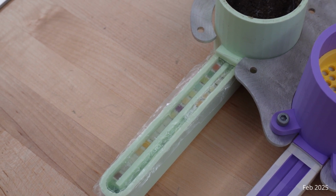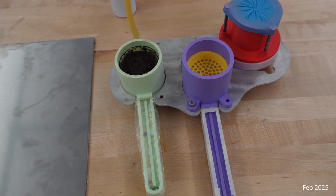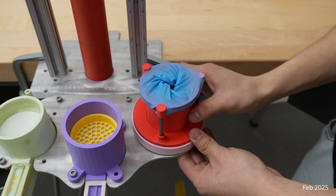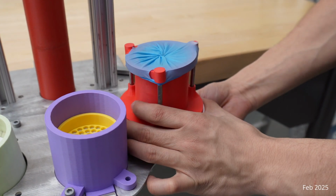At the conclusion of the first test, the auger rotates to direct the collected soil into another testing chamber for the second sampling site. For the cache sample, the auger rotates to deposit into a third container, which is rotated by a stepper motor to be sealed. This can be easily removed for examination.